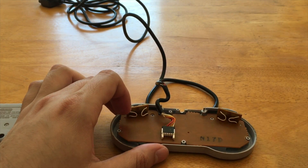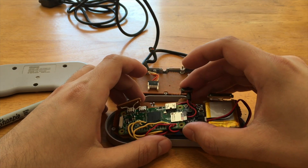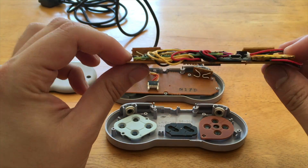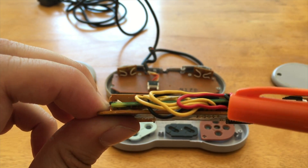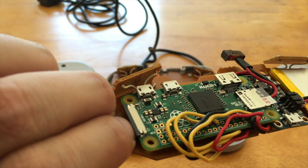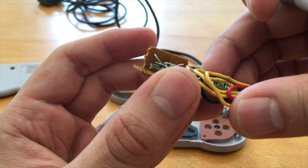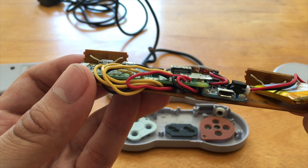I used a standard Sharpie marker to lay things out and draw where I'd want them to sit. That made placement pretty straightforward. You can see how it's now a nice little self-contained unit — the controller pins are wired directly into the Raspberry Pi's GPIO pins. From a space perspective, these things wouldn't sit flush next to each other, so I had to raise the Pi Zero up just a little bit using a command strip, which gives just enough clearance over the Power Boost to keep them from conflicting.